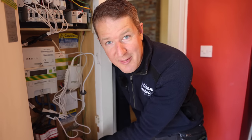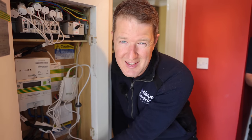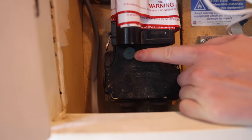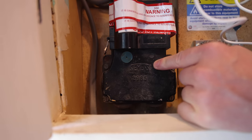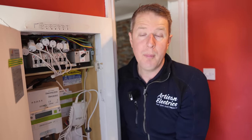I'm learning a lot today from John because he used to work for the DNO, so he knows all the little inside secrets that only the DNO guys know. One of them is this little blue nodule here - this little blue thing shows that it's on the blue phase, this particular supply. In the past the phase colours were red, yellow and blue, so blue would be L3. Now we have brown, black and grey, so grey is now L3.